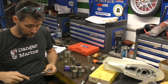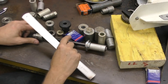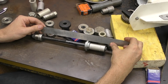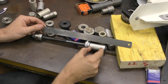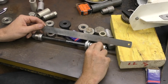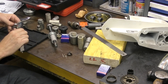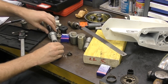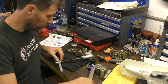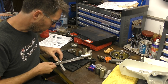Just doing a little sanity check of the measurements — there is exactly 30mm between the tops of the two bearings, so it's just a double-check to make sure our measurements make sense, and they do. So if I put an old bearing on, the top of the bearing is level with the underside of the lip of this tool. Even if I roughly pop it on, I can see that this spacer is about 10 millimetres too short — we're at 172mm and we need to be down at 162mm. So what I'll do is get some washers and pack this out until we get the right depth. Adding washers measuring 11.8mm and 9.4mm — if I put a right angle across the face of the tool and measure down, we're pretty much dead on 162 millimetres now. So this is what I'm going to go with.